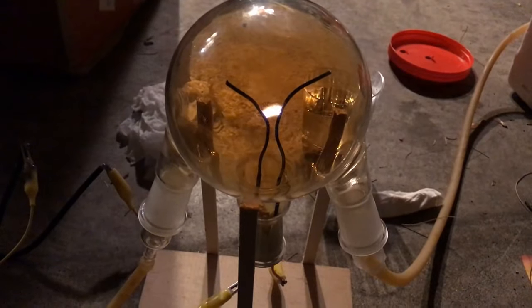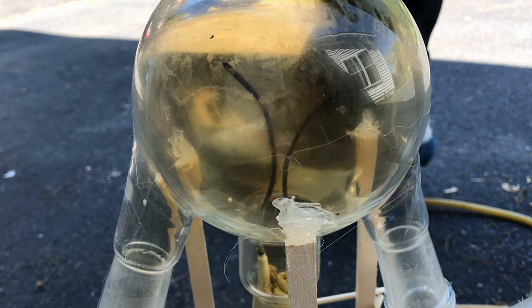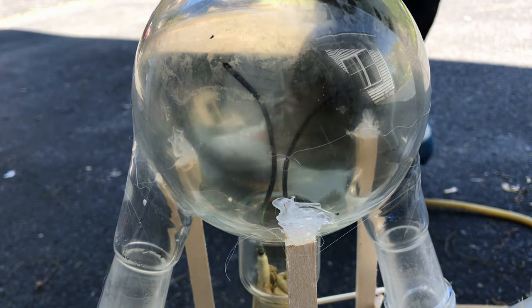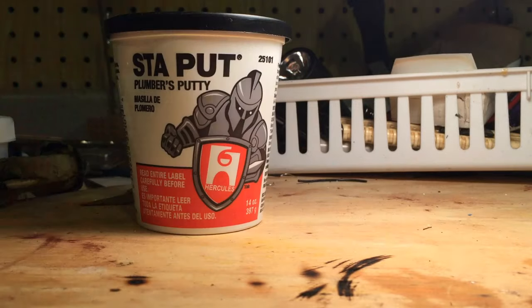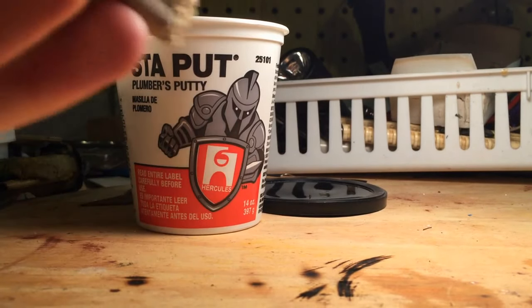Now on to how I built my reactor. When I first began this project I made a lot of broad assumptions, such as thinking I could use a plastic vessel to house the electrical arc and plasma — which turned out to be extremely wrong. I switched to using only glass vessels, and the vessel I landed on was a three-neck 500 milliliter round bottom flask. Turned upside down, the two side legs act as inputs and outputs while the middle leg serves to both plug and introduce electrical wiring. Creating an insulative and airtight seal on the middle neck was very difficult, and it took many hours before I came up with the idea to use plumber's putty as the main sealant, allowing the wiring to pass in and form the Jacob's ladder mechanism.